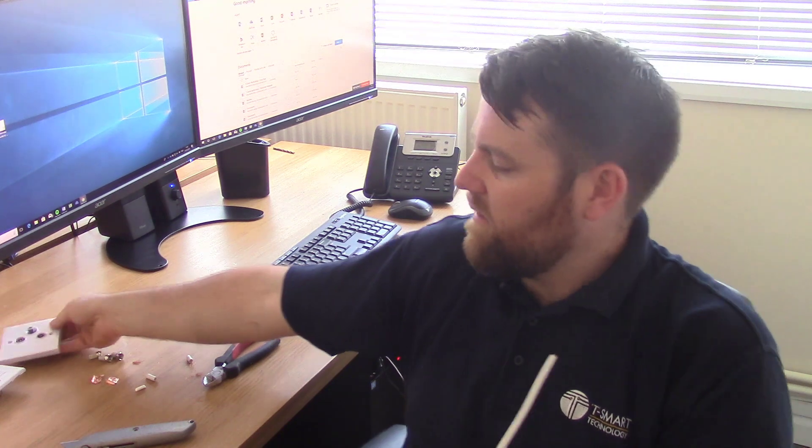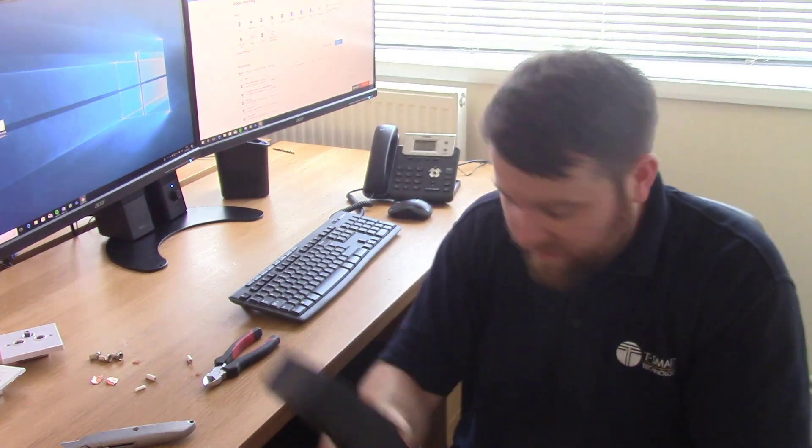You've got to be careful because both types exist. Some wall plates aren't diplexed — meaning if they've got two connections on the front, they take two separate cables in. And some are diplexed. Although a socket might say TV FM on the front, you really need to flip it over to the back to see what's actually going on and how you'd install it.